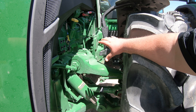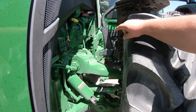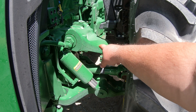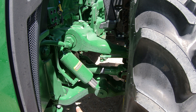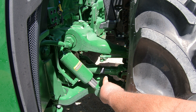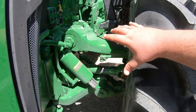On these 8Rs we have a really tight space — not much room to get back behind the machine to show you where these grease points are. But I want to point out how this independent setup is kind of like it would be on an ATV or a UTV. What we're going to see is one A-arm that comes out at the top, one A-arm at the bottom, a stabilizer cylinder, and your actual driveline in the middle that runs out to the wheel. So we have a ton of moving pieces in here that adds up to 10 different grease points.